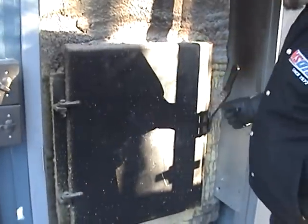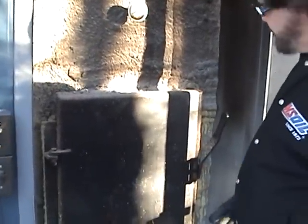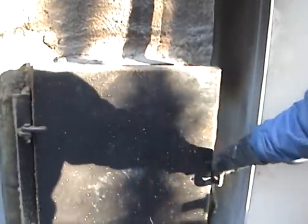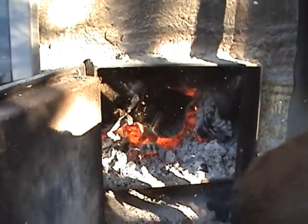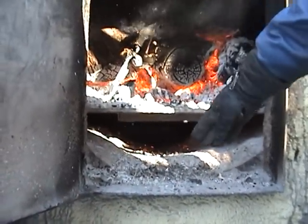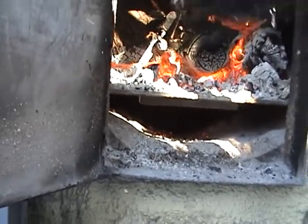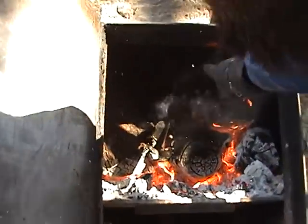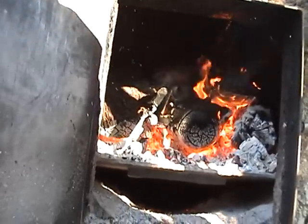This door was the only thing that I purchased — I found a deal on a door. The door is nice and big, 23 by 18 inches. You can really get big wood in; basically whatever you can lift will go in there. The ash pan is down in here — the ash falls through the grates, and every 15 days I have to pull the ash out; you get about one bushel basket full each time. The smokestack hangs down in the back so we trap all the heat up in the top. Those two pipes in there are where the water is going down and back through the fire one more time for another heating.